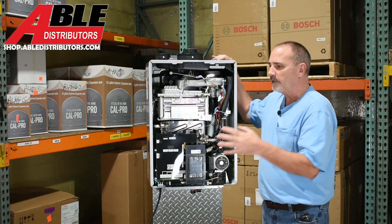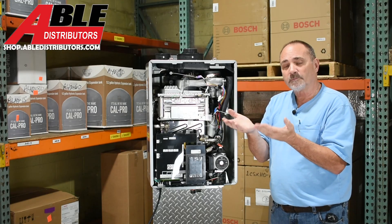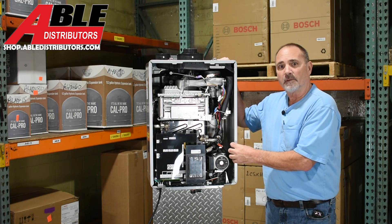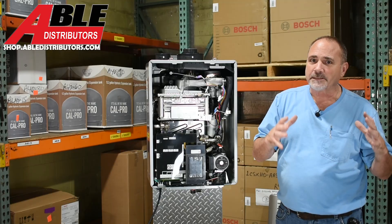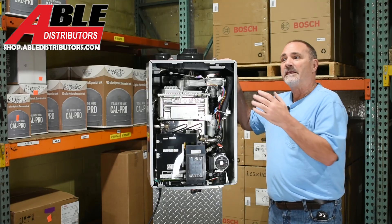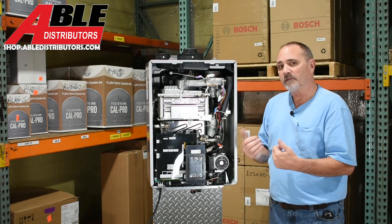I really love the versatility. We're bringing these in in 90, 150, and 199 BTU models. Before, you had to buy the biggest combi boiler to ensure enough domestic hot water, and sometimes the boiler was just too big. Now we can match the heating BTUs correctly — and on the domestic water side, they're all 199,000 BTUs. It does modulate. You'll get 5.1 gallons per minute in dedicated domestic priority mode, and 4.1 GPM if heating and hot water run simultaneously.